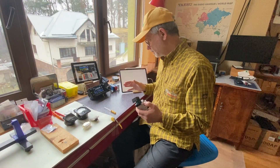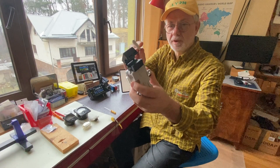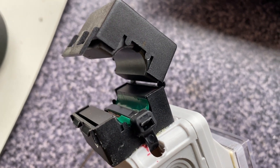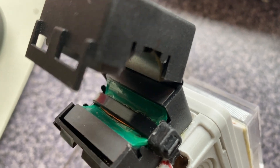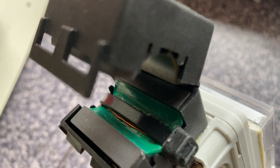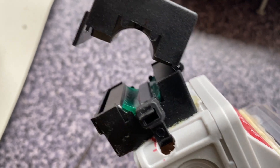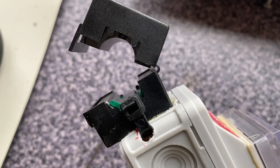Alright guys, let's jump back to the workbench and do some reverse engineering of this device. First of all, this is the input transformer, which is made of an RF clamp-on ferrite seated and glued to the box with PE-suitable glue. You can see the green stuff inside the transformer — that's simple electrical tape just to prevent the transformer wire from scratching. The transformer wire sits under a zip tie lock, which is used to fix the transformer to the box even more firmly than the glue, making the whole construction more sturdy and rigid.